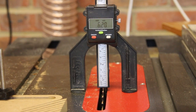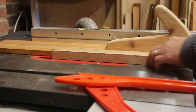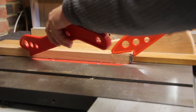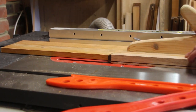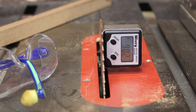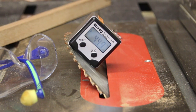This next cut needs to be set to exactly seven millimetres. The next cut would be better done on a router table, but my son's on nights so I don't want to make too much noise, so I'm going to do this using the table saw. These two cuts provide the lip that the tiles will sit in. I also need to cut a chamfer on the top, so I set the blade to 45 degrees.